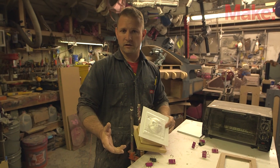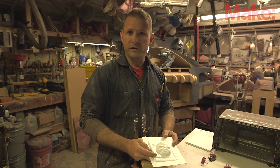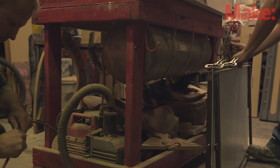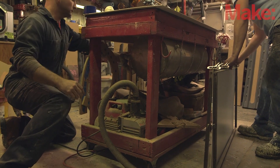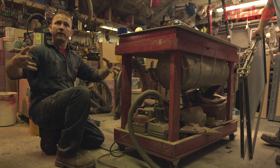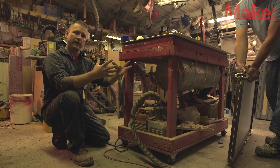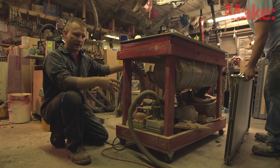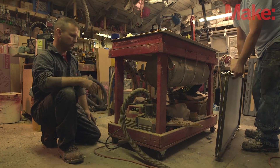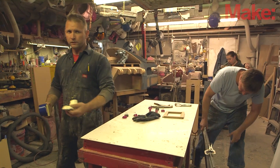Bear in mind that vacuum forming most of these plastics is going to release some fairly noxious, toxic chemicals, so make sure you're doing it in a well-ventilated area. If you're planning on doing it in your mom's kitchen, make sure you ask for her permission first — she's going to say no, and she'll be right. I've got a high vacuum source that pulls a vacuum on a tank, giving me quite a volume of very high vacuum. I also have a shop vac which evacuates a lot of air in a hurry — low pressure, high volume — and then I switch over a couple of valves and it draws air into the high pressure, low volume side. The pump is actually designed for servicing automotive air conditioning systems.